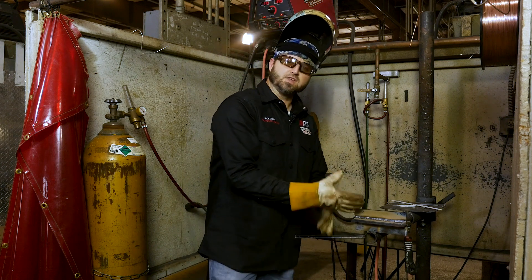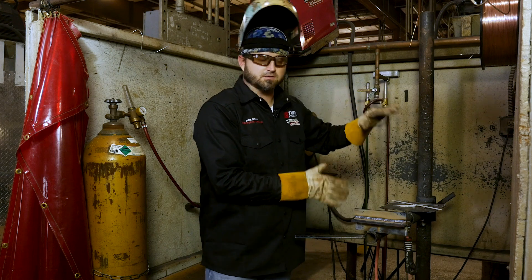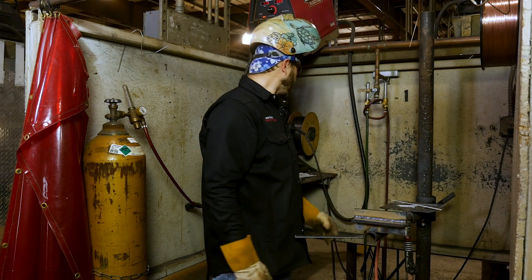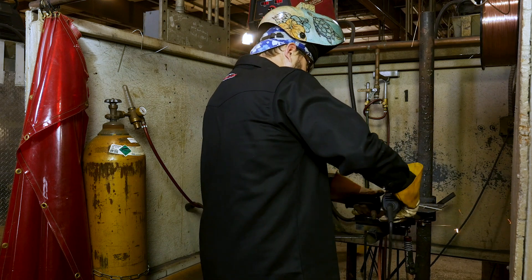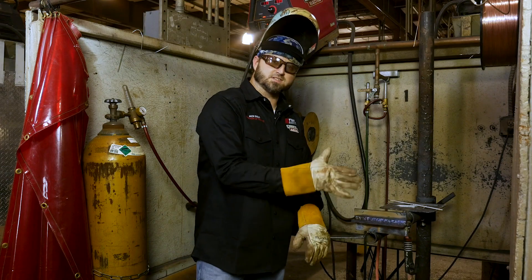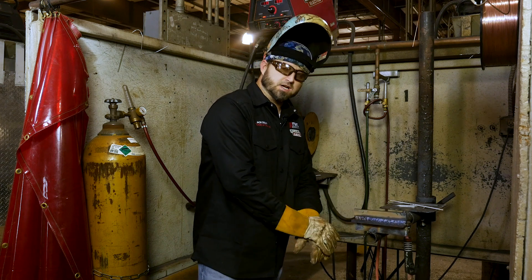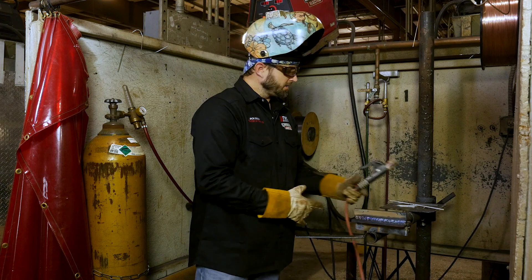If you don't run the right angles, your leg lengths are going to start wandering — either too much down on the bottom, or too much up the plate. It's all about the right angles so you get the right leg lengths on your fillet welds. Let me clean this up. The beads are all in there nice and smooth with a nice fillet weld going. Here at the school we make you run six beads or more, because we're simulating welding out multiple bigger pieces with multiple overlapping beads.